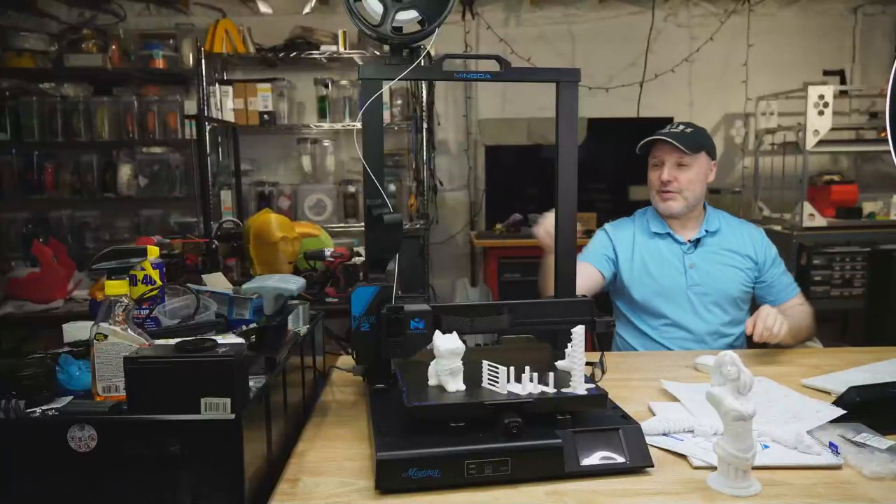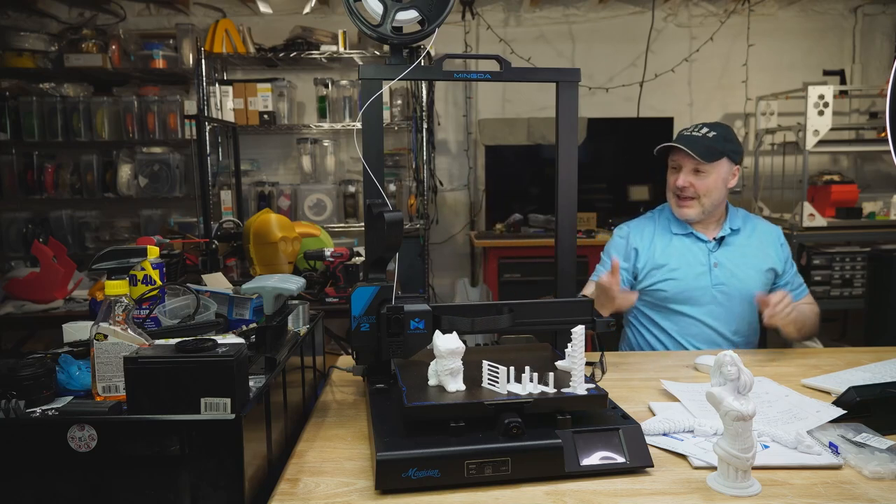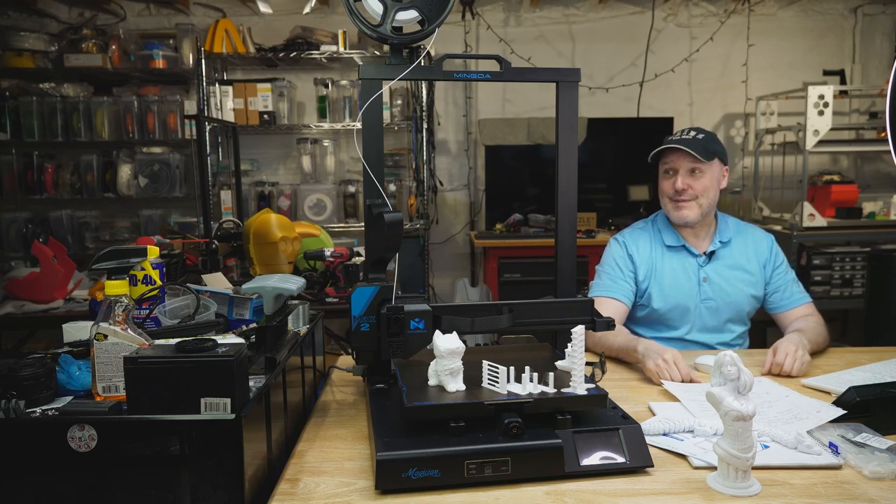Printing-wise, I didn't have too many issues once I had the filament dialed in. I have had some issues with stringing and had to do a few retraction tests to make sure I had that just right. I've also had to make sure my material is dry — it's summertime here in Maine, it's been very humid, so my filament has spent a lot of time in the filament dryer before being loaded up. No issues printing overall. And anytime you see these printers with these cables, sometimes people wonder how long these last — honestly, no issues so far.